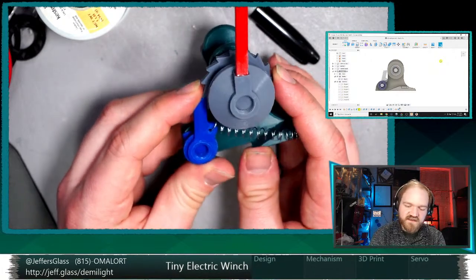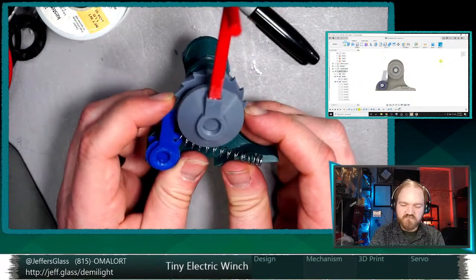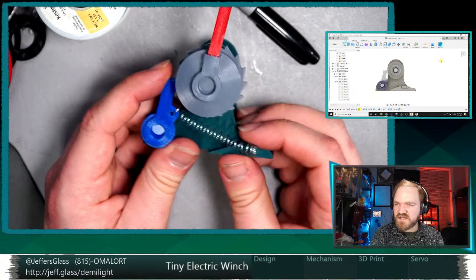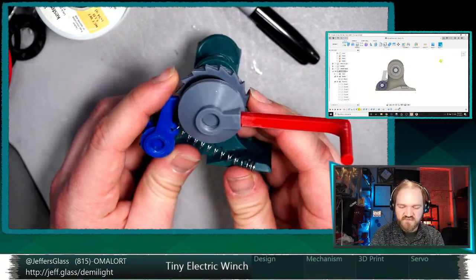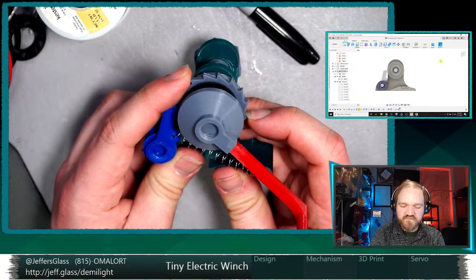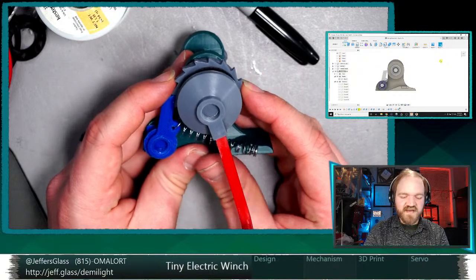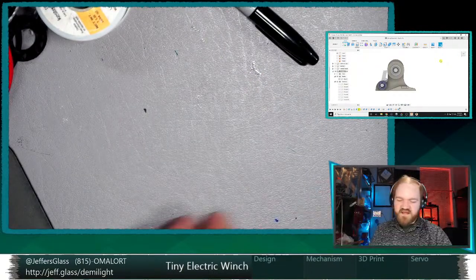The other thing I'm thinking is that maybe this is not an ideal sort of pawl form factor, right? This sort of class 3 lever design, which needs a big fat spring hanging off of it, is maybe not ideal. This could be made more compact in a couple of ways, but the way that's sort of leaping out to me is, he said reaching for a sketch pad again,